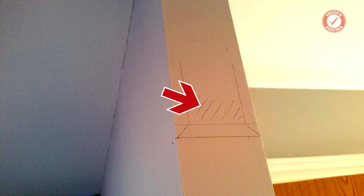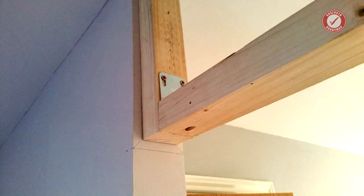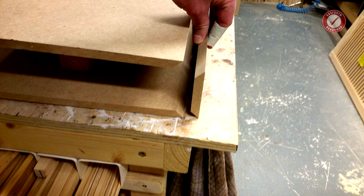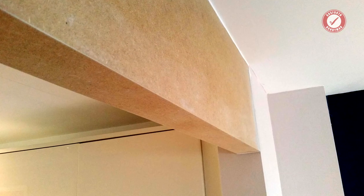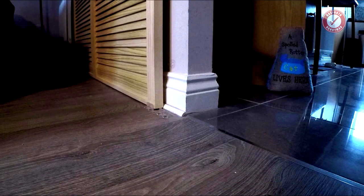I've measured up from floor level and marked the wall at 1957mm. I'm using 12mm MDF for the finished surface, so I've marked the exact thickness — the shaded area shows the size of the framework I need to build. The framework needs to be a precise thickness so you don't see any transition between the plastered wall and the MDF once installed. I ripped this to size on the table saw in the workshop, installed the framework, then installed the MDF panels using bevel cuts on all the lower edges — the main reason being so I don't have to deal with any MDF edge grain. This was all brad-nailed and glued in place, then all nail holes and transitions were filled with two-part filler before sanding everything smooth and flush.